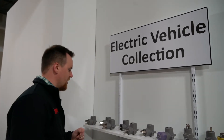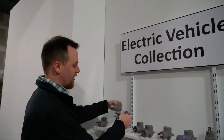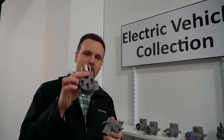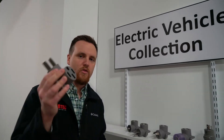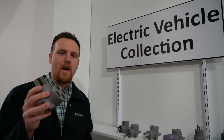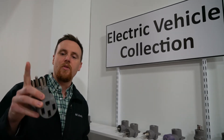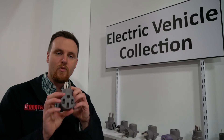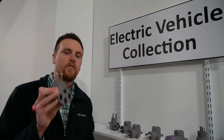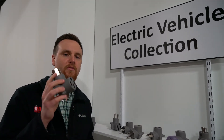So when you're looking at our other EV adapters, like these gray ones right here, you'll see mostly either four-to-four prong or three-to-four prong. When you're looking at four-to-four, you can use this for any type of EV that you have because it has ground and neutral. But when you're looking at three-to-four, you can only use it for Tesla because it's built specifically for Teslas.